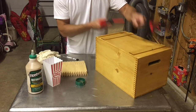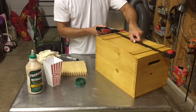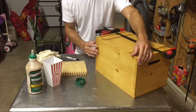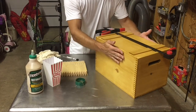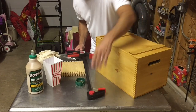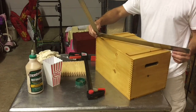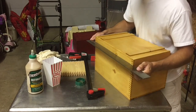To press the whole thing together, I just use a clamp, press it together, and that's it. Once it's in place, it really doesn't budge — with a box joint like this it's not going to separate. If it is a really warped board, I may leave a clamp on for an hour, but I don't want to have indents or have the boards get squeezed — sometimes they squeeze in and it doesn't look right. After squeezing the boards together, check it for square. I usually just use my edge, make sure I'm the exact width on both sides, and put it up to make sure it looks right.